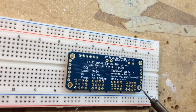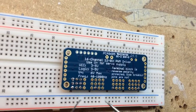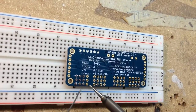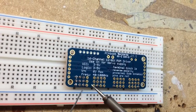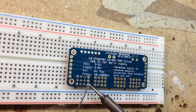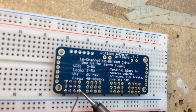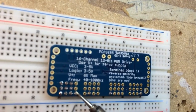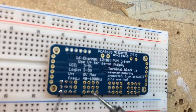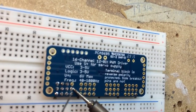There are 16 connectors, one for each possible servo, and three connections each, so there are 48 total connections to solder. To solder, you just put the tip of the heated soldering iron here and touch a little solder to it. You have to hold it there until you see the solder is flowing a little bit — and that's about all it takes. That one's done, then you go to the next one.